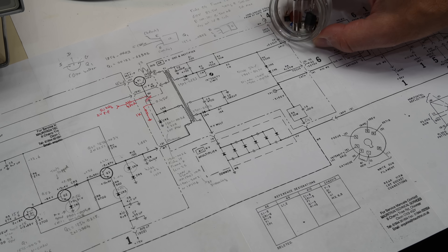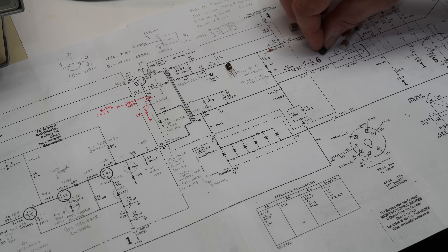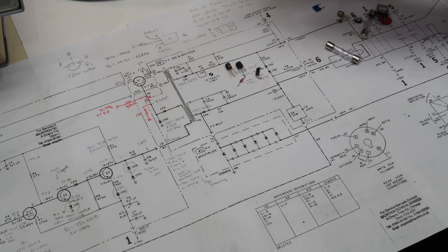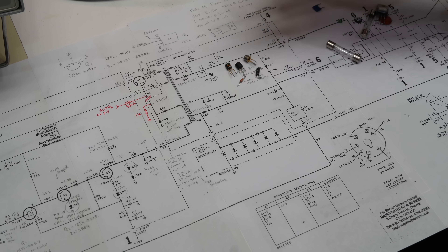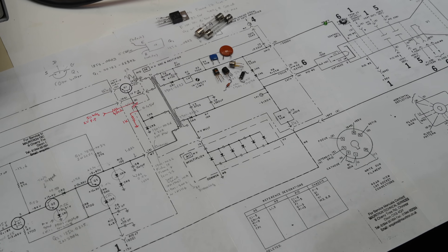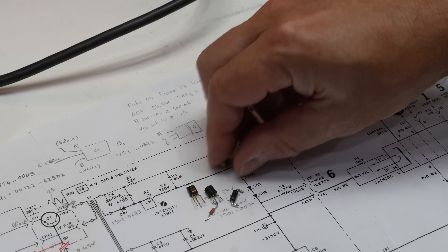So let's wrap up our repair of the high voltage power supply. The components that were really dead — it's not that many. Dead for sure: the two input transistors in the control circuit, the JFET and the regular transistor, and a small signal diode. Also in the high voltage board, there was one bad diode. Out of caution, I changed the third transistor in the control board because it looked a little weak. When it was not starting, I changed two caps, but in retrospect I think they were good — it was just the diode and the high voltage preventing it from starting. Also during the repair I tried to change the power transistor, but put one that was too good. And then we blew a few fuses. It was just hard to find.